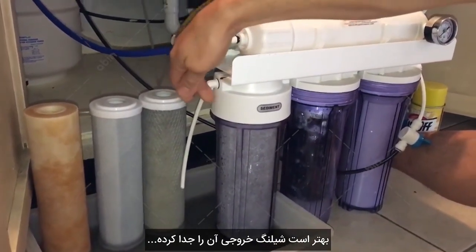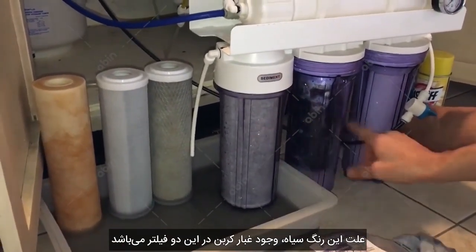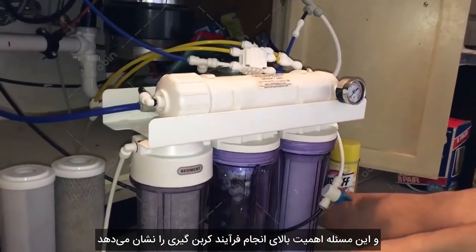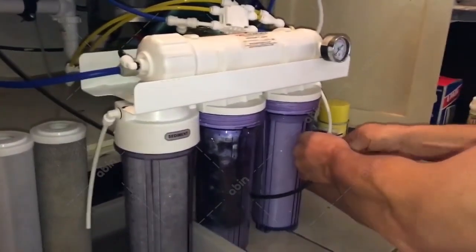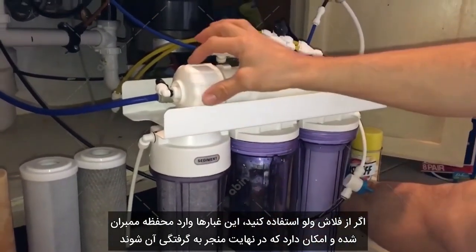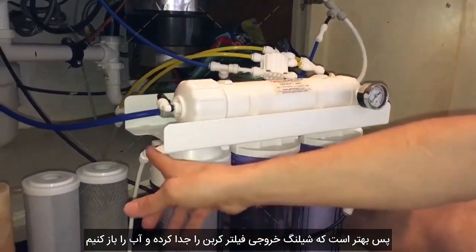As you can see in this water, it's pretty black — that's just residual carbon dust that was in these two brand new filters. All that carbon dust would actually clog up your membrane prematurely, so it's very important to run this flush before you put it into service. This is a preferred method as opposed to using the flush valve — if you use the flush valve, you get a lot of the carbon dust in the chamber of your membrane, which could eventually break off and clog up the membrane as well.